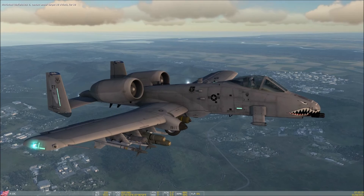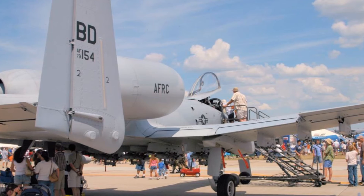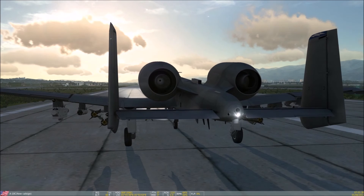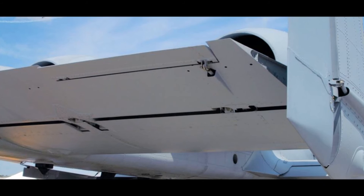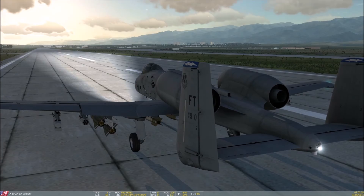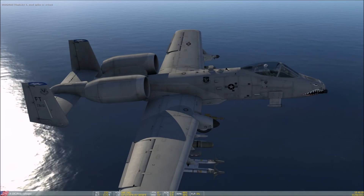Moving on to the rear of the aircraft are the elevators. The two elevators are attached using a shearable crossover shaft that can be disconnected if one of the elevators becomes jammed, using an elevator emergency disconnect switch — allowing the other elevator to operate, though with less pitch authority. Like the ailerons, each elevator is powered by hydraulics; should one fail, the other takes over. If both hydraulics fail, the manual reversion flight control system allows control to be shifted to mechanical push rods and cables. Yaw control is provided by two rudders, each powered by multiple hydraulics, connected to the rudder pedals via a cable and linkage system should both hydraulics fail. Unlike the elevators and ailerons, there is no emergency disconnect option for the rudders if one were to get jammed.